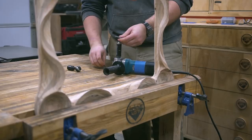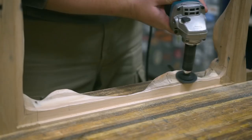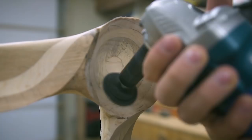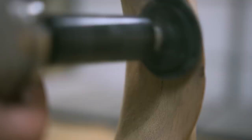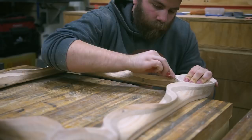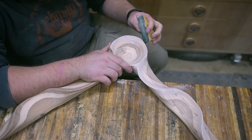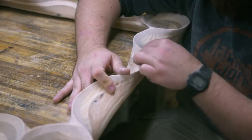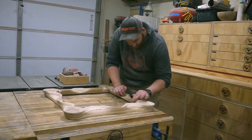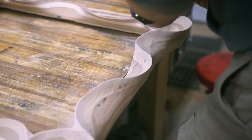The final power carving tool I need is the contour sander, which I use for all of the finish sanding. It has random orbital motion, so it's less aggressive but leaves behind a really smooth surface — I can sand through the grits up to 320. I've left the sharp edges alone until this stage because I want to keep them as pointed as possible to give the eye a clear transition between one side of the ribbon and the other, but inevitably they get too thin and splinter off. With hand sanding I smooth out those inconsistencies by softening the corners all the way around the frame, tricking the eye into believing it's looking at a perfect line.